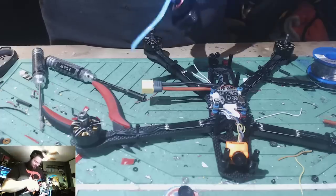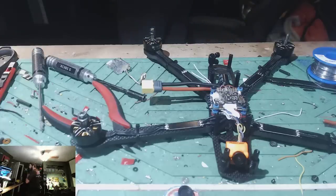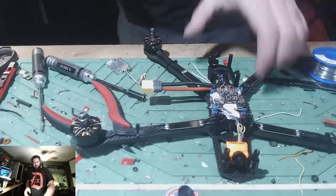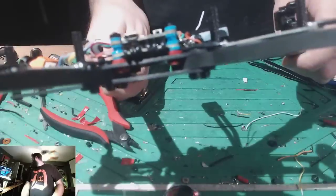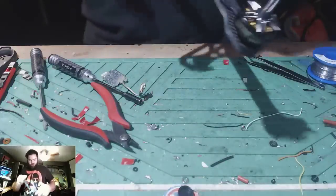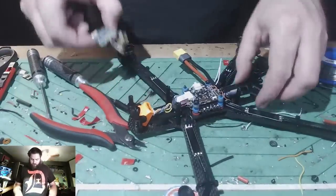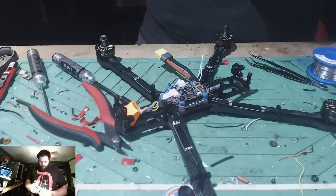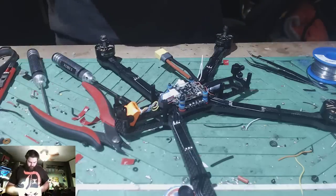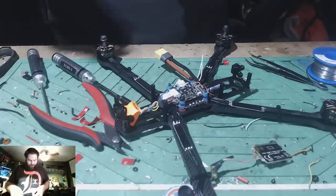Yeah. So you can actually pull that, and then he underslings it. It's really easy to undersling on that quad because there's that big gap, right, where the grommets are. So you just throw a strap under there, throw a strap behind, on the back of the frame. That's probably where I put my VTX. Yep. I've been meaning to 3D print a spacer so that the battery's not getting angled. That's in the works for people who want to fly 6200 milliamp 5S's or 6S or whatever. AKA just for Benson.